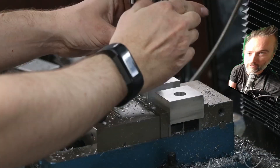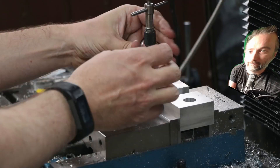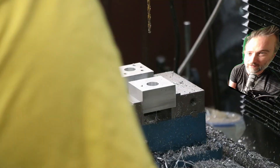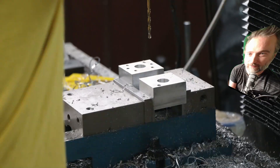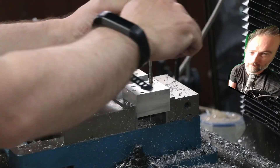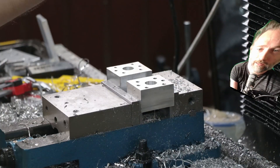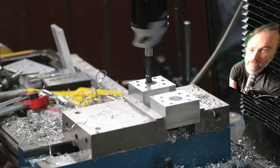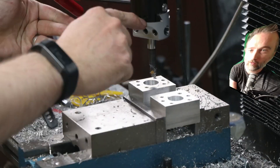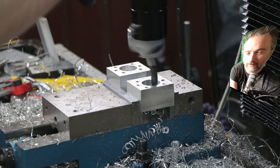I decided to drill and tap the holes before I switched the chuck over to the boring head, which makes sense. Lots of tool changes - you're still doing at least a drill and a tap change for every hole. Now over to the boring head, and this is where having the two coordinate systems really pays off, because you're incrementing the diameter out on the boring head each time. Being able to inch both holes up in step with each other, rather than doing it all the way through one and then repeating the whole exercise on the other, was quite useful.